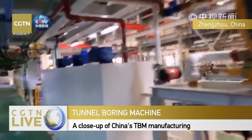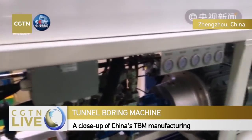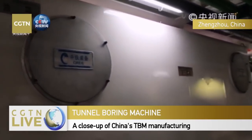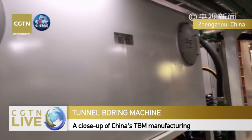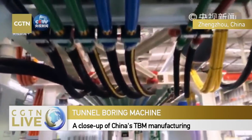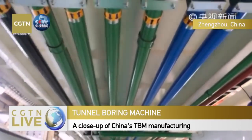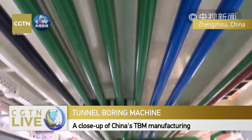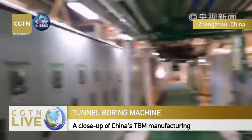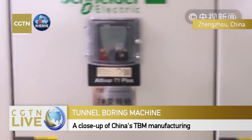The TBM is totally waterproof - water cannot get inside the machine. This is also the engine. This is the oil hydraulic pump that provides the energy to push the TBM moving forward. The blue path is for wastewater. The blue pipeline is for internal water usage, the red one is for the air pipeline, and the different colors represent different usages of either water or air.